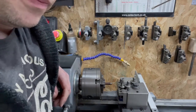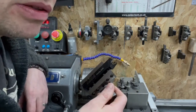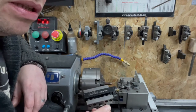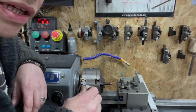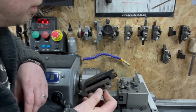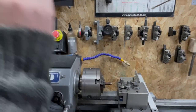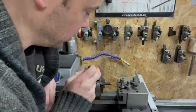Carbide insert tools, that's the future. Which is what I use when I do metric threads. Even though I am cutting, I'm using an imperial cutter, 55 degrees, to cut a metric thread on an imperial diameter bar. Yeah, I know. Tell me about it. So options there is, I can regrind that, but if I'm off center slightly, I'm going to destroy the threads I've already cut.